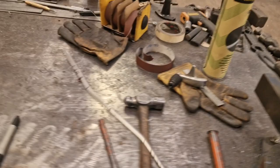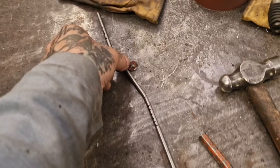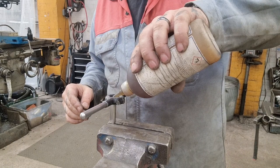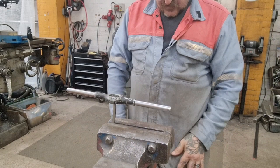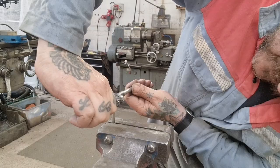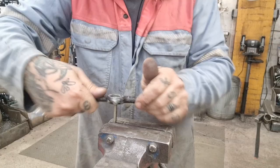So we'll take it over to the bench vise and clamp it in place and use a hacksaw to trim it up, use a sander to put a bevel on it, and then we will hand cut the thread with a die like so. Yeah. Righto, so with a bit of lube and the old die, I've started it off camera and it's hard work, if I don't mind telling you. Check that squarish, move it around this way, that's squarish. Yeah, so now we can thread this down to where it needs to be,